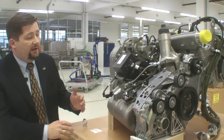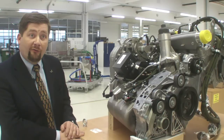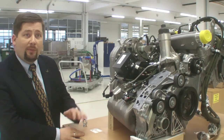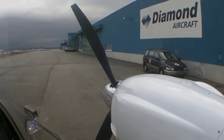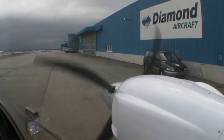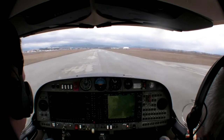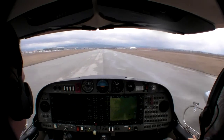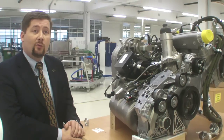The initial automotive engine has a maximum output of 140 horsepower. In our application, we use a different setting in the motor management system from the ECU, which allows us to operate this engine with up to 180 horsepower — 170 horsepower takeoff performance — through modification of the fuel injector timing and changes to the motor management system.